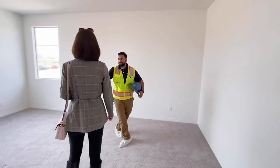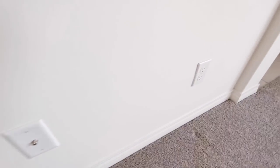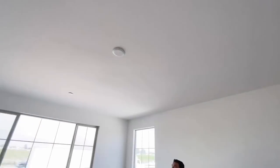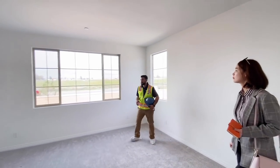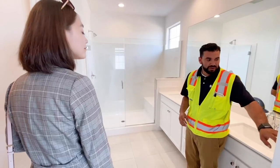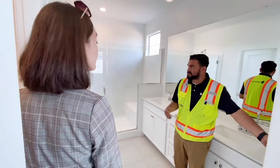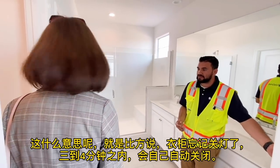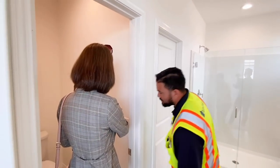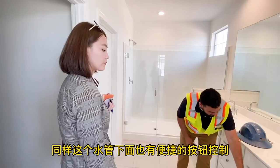You'll have your cable outlet right behind you. Right above, you also have your pre-wiring for your ceiling fan and two fire sprinklers. Straight ahead is the master bathroom — you'll have a light right above the shower, then your vanity light, and the last switch is for your fan. Here is the fan control, and you have a fan in your toilet room as well.